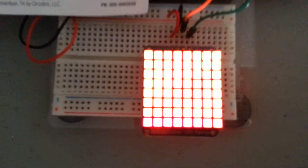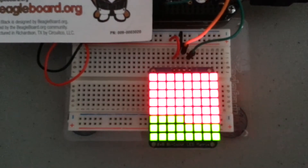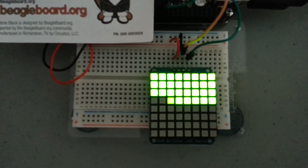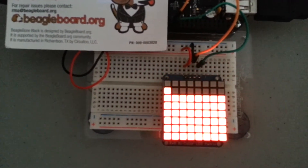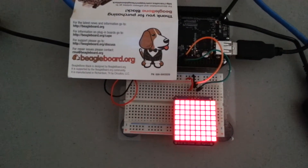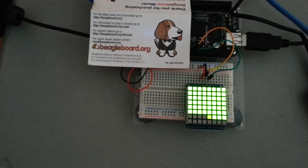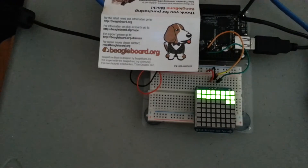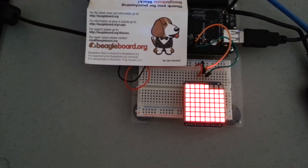Let me go in a little bit closer. This works with the BeagleBone Black because Adafruit wrote a Python library for the BeagleBone Black that's very similar to the Raspberry Pi's IO Python library, so the BeagleBone Black can reuse all the Adafruit code for their modules that work on the Raspberry Pi. This is just using the Adafruit LED backpack code and running the 8x8 color demo program.